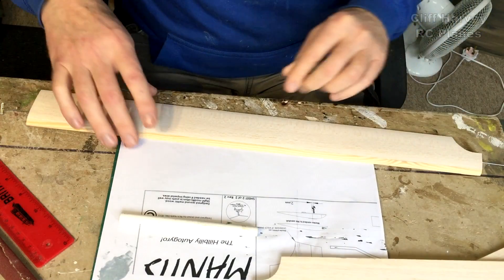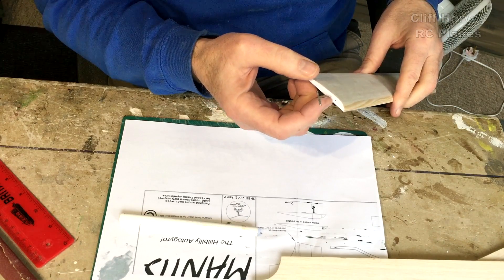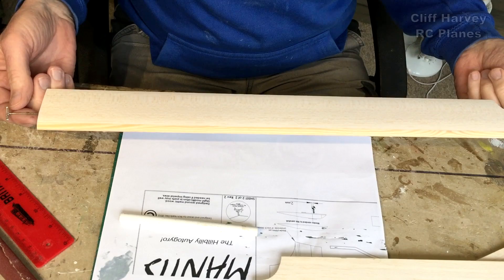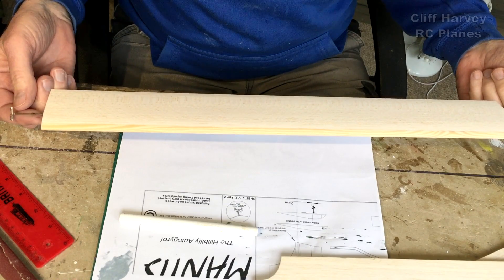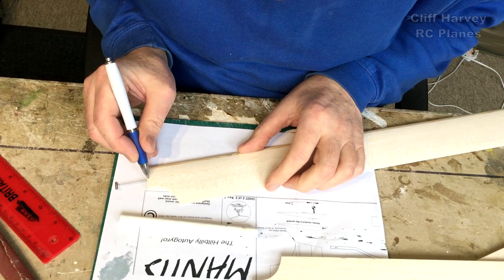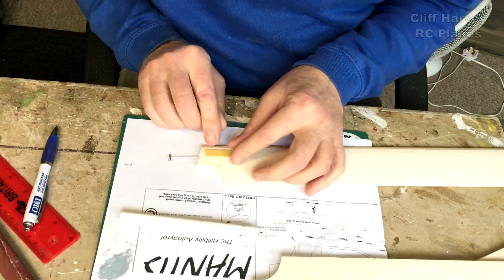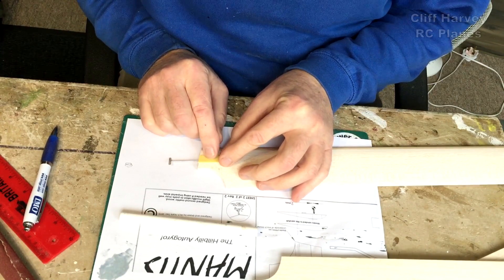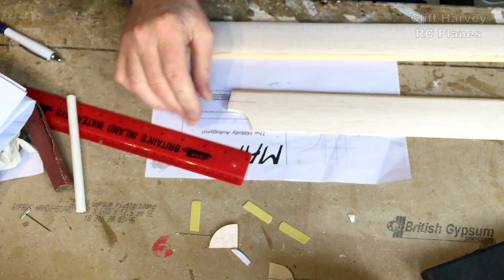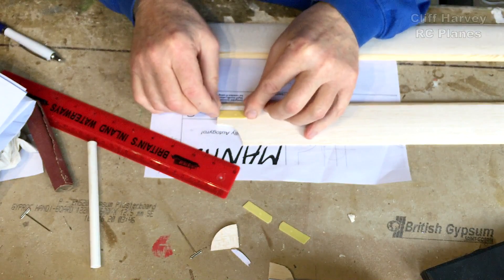Now I've got to balance the blades span-wise. I've just tried at that position — it didn't work. I've moved the pins back a little bit, one each end, and just on my finger that's pretty much spot on straight away. Next job is to mark that position on the blade — that would be the position where this is glued, except you measure back two millimetres from that line and that's where you drill your hole.